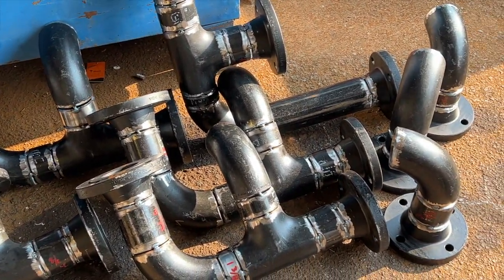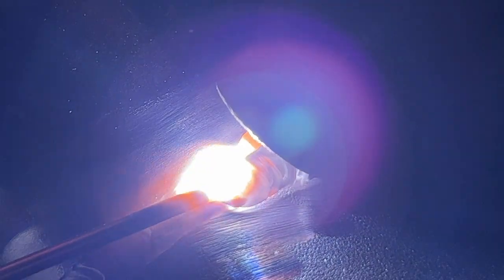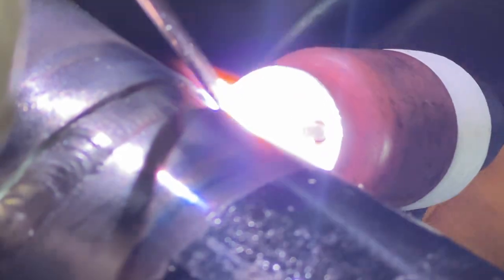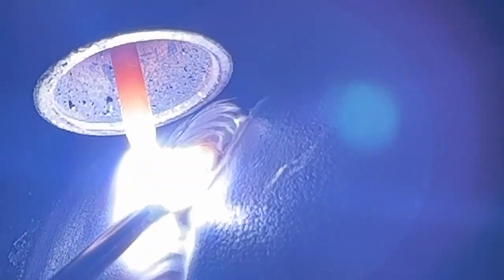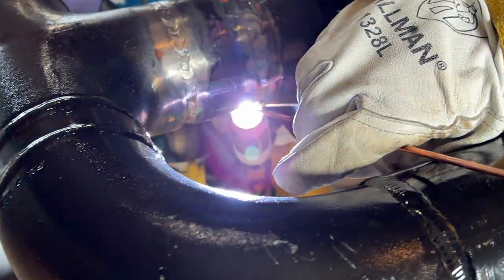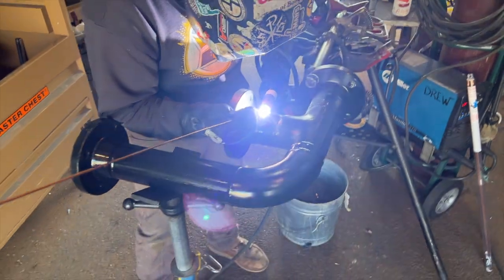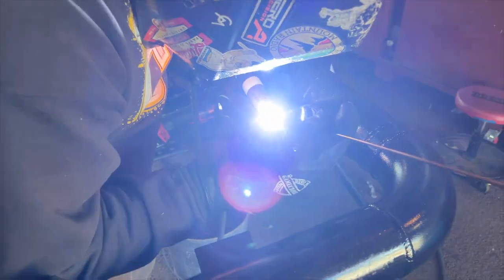Most of the welding can be done down here on the bench, with a few position welds. Most of these will be flange connections bolted together inside the cabinet. The piping is just low pressure — not getting x-rayed or DP tested — so we're giving them an eighth-inch gap to an open-root weld on Sched 40 carbon steel. Corey's getting full pen on the root with 3/32 wire, followed by an eighth-inch hot pass and an eighth-inch cap with ER70S-2 wire from Blue Demon. He's running the Blue Demon Game Changer TIG gloves and using the MaxStar 210DS plugged into 240 to make these welds.